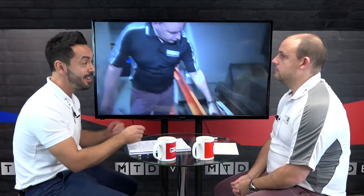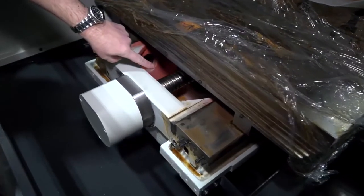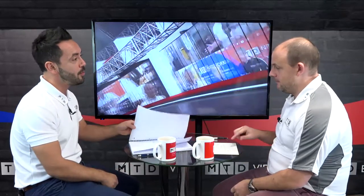You can see the size of the ball screws on this — it's a 1250mm X-axis machine from Ward High Tech. It's nice to be able to see what you're actually getting for your money. Vibration is a killer of cutting tools and the machine in general. You can see the size of that ball screw — it's not just wear on the machine, it's wear on the cutting tools too. If you're replacing inserts very regularly because of vibration, then having a bigger, heavier duty BT50 machine is an option. Chatter affects component quality, surface finish — loads of advantages to a heavier build.